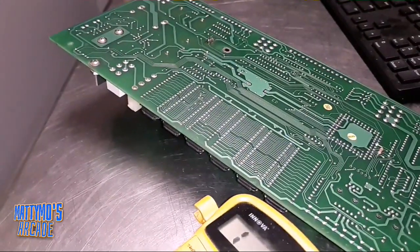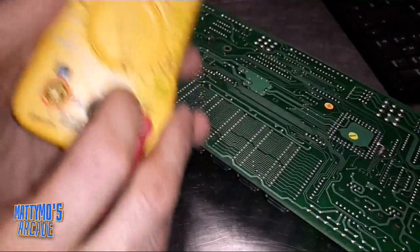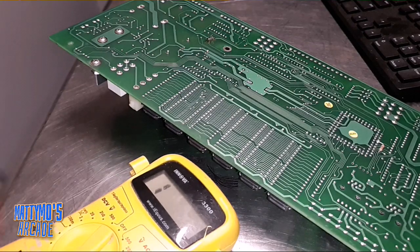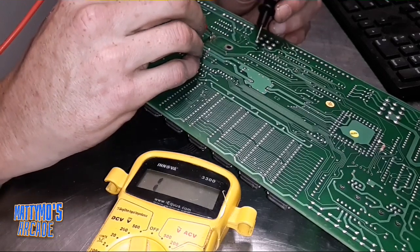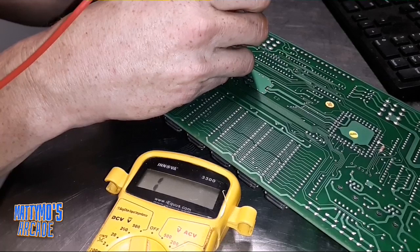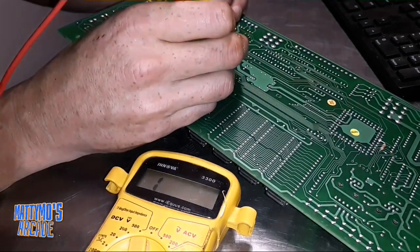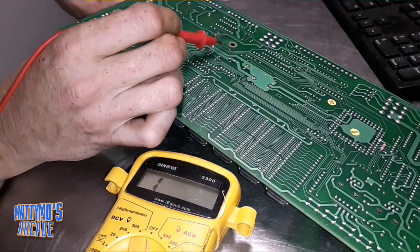I got the little tripod out, see if we can get it working enough. So we want to see this zero out — I have it on diode test. We're just checking for continuity to make sure that the trace is not cut, but with it being all burnt up like this, I have a feeling one of them is probably going to be off. Let's start with this top one here. Alright, that one's good. The middle one — okay, that one's good. Maybe I'm wrong here. Nope.